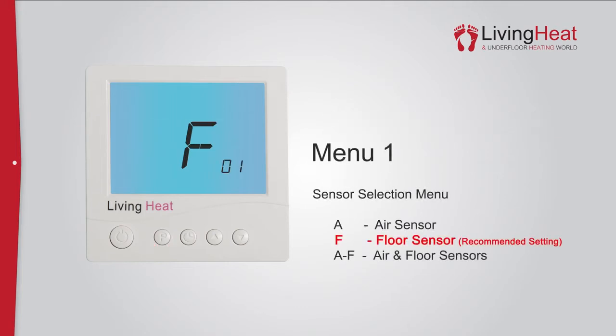Menu 1 is the sensor selection setting. You can choose between air, floor, or a combination of air and floor sensors together. Use the up and down buttons to select F for floor sensor, A for air sensor, and AF together to regulate a combination of the two. We would recommend setting menu 1 to F only, as this is the most accurate way to regulate underfloor heating.